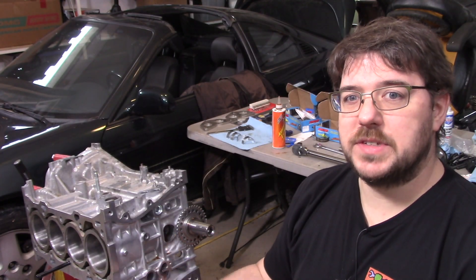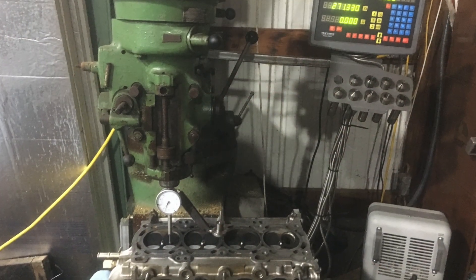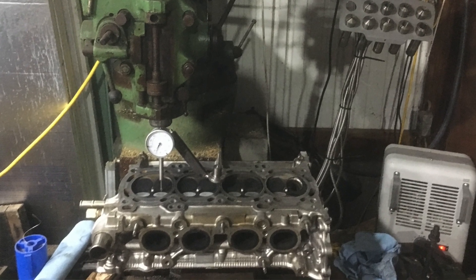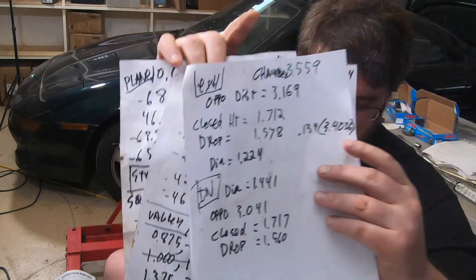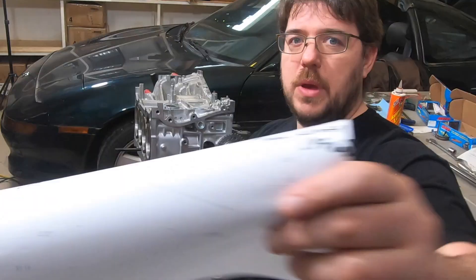It's not a ton of assembly to the 2AR, but we've got some stuff done. The next thing I did is a whole bunch of manual digitizing with that indicator and the DRO on the mill, as you can see here. There was literally about three hours of it, so I'm going to spare you the footage. The end result is this kind of stuff — a whole bunch of paperwork and numbers. With those numbers, I'm able to put a lot of work towards figuring out the exact valve geometry and be able to make this drawing.